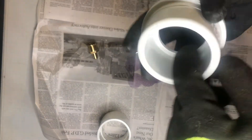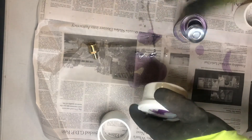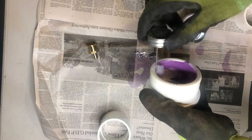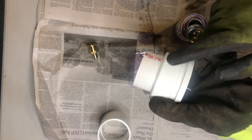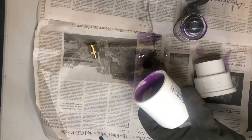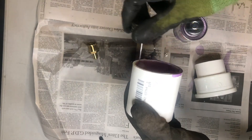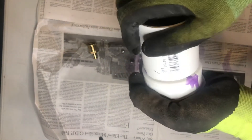Here's the slip end of the two-inch union — a piece of PVC is going to go in here. I apply primer with a nice swirl, let it drip out, then a nice coating of PVC glue and put it in with a twist. Now comes the two-inch coupling on this end — a generous amount of cement so it drips on the paper, meaning I've got enough. As I turn it together you can actually feel it getting tight as the glue heats up and cures.